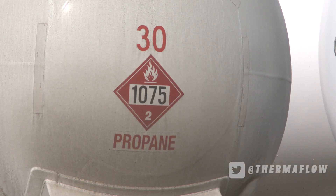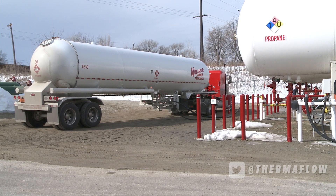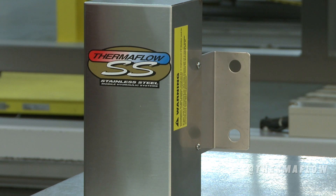Since we put the 100P on our bulk trucks, we've noticed that we maintain a constant flow all the way throughout the whole load. On the other trucks without the 100P, they'd pump good at the beginning — maybe 60, 70 gallons a minute — then towards the bottom they'd drop off to 35-40 gallons per minute and chatter a lot because they weren't getting a full flow of propane at all times. With the 100P, it takes the antifreeze from the motor and runs it through this heat exchanger with propane, bringing it back into our supply tank and keeping the head pressure up on the pump at all times. It runs smooth all the way throughout the whole load. We love them.